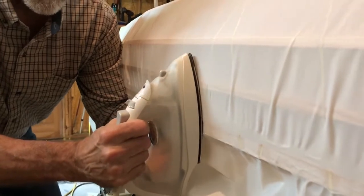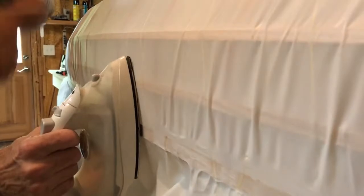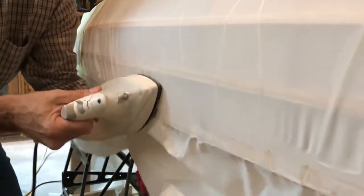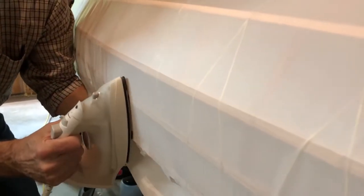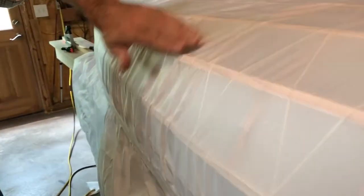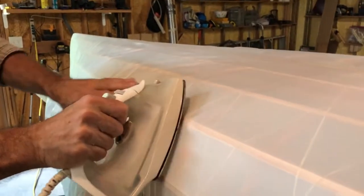If you have an actual crease on a stringer, pull it a little bit and then apply heat to the area you just pulled out. That'll also pull out creases in the other direction — you can see it's pulling that crease out as you go along. That whole area filled with little creases and wrinkles is now gone. The difference: a wrinkle has kind of a wave in it, while a crease has a very tight, sharp edge. You try to push those to the point where they won't do that, then iron around them.